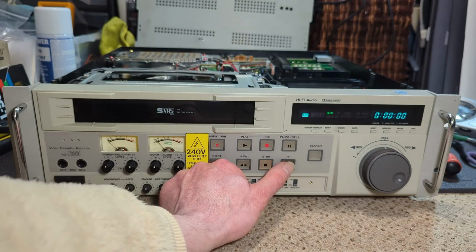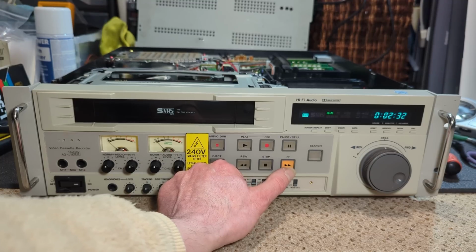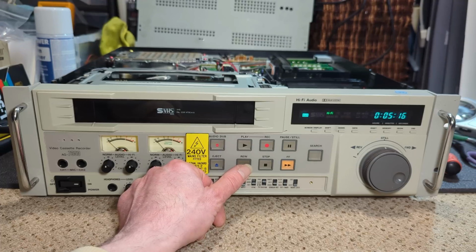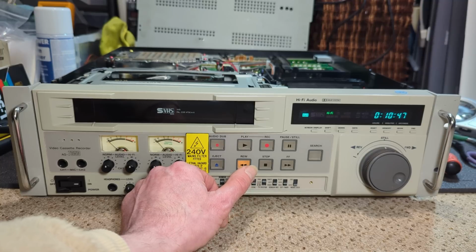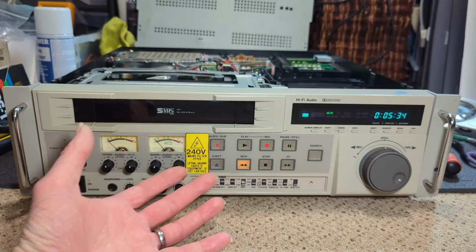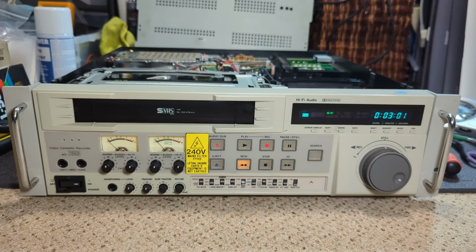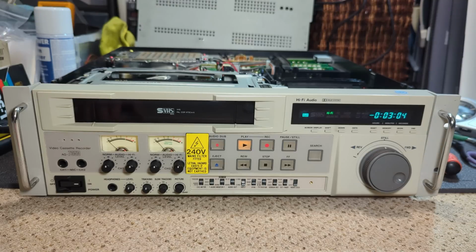Okay, so it's laced. Unlacing to go. Well, was it really as simple as that? I'm never lucky enough to find, oh, it's a leaky capacitor, change it and it'll work. Oh, that's unbelievable. Like I say, everything else looked fine, but I just know Panasonic kit well enough that chances are there will be a visibly leaky cap. And yeah, let's just do a capture.